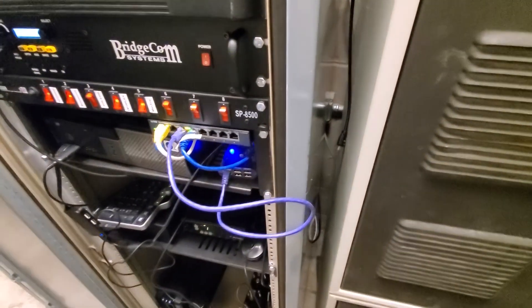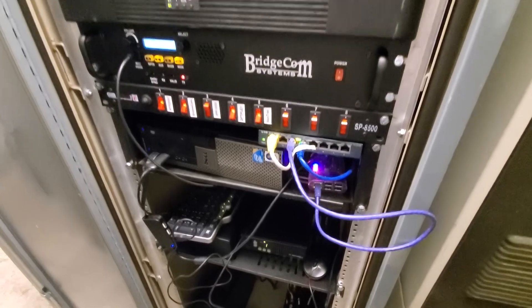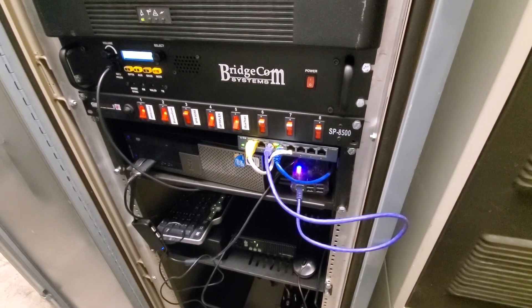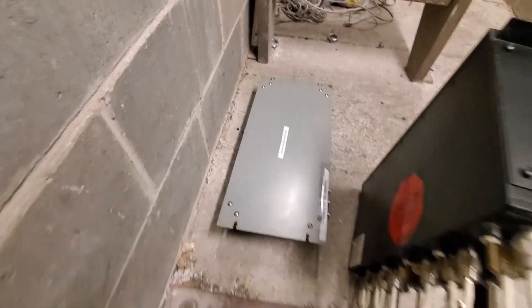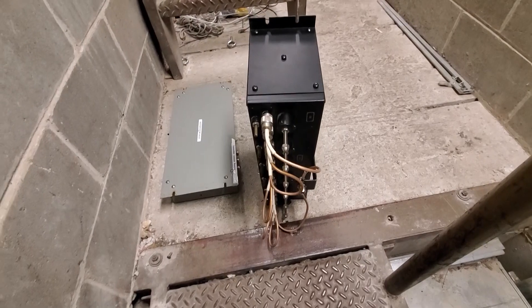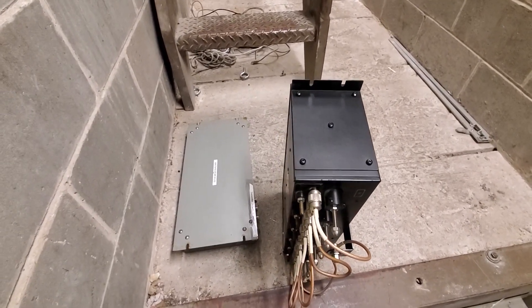When I hit the parrot it should not light up. KC0QBT — and I don't see the clip light coming on. So we've got a good working machine. It's just that when we get out and about it starts failing at probably about three or four miles south of town. We're going to test this, and if this isn't it, we're going to pull the duplexer and retune it. We think there might be a duplexer issue, so we are going to pull this duplexer that was on that repeater, take it back, retune it, and ship it back to Thomas.